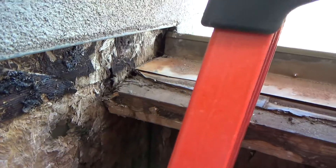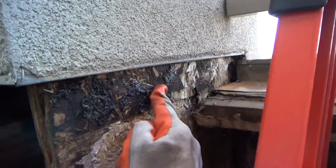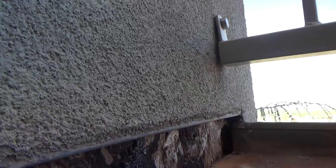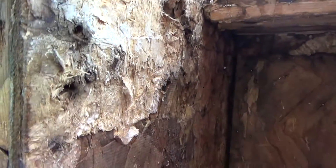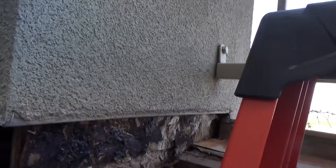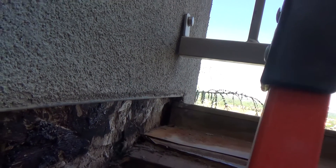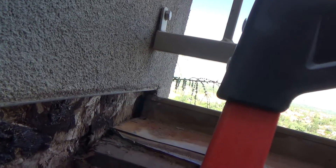I just need enough room to take this plywood off, because I'm gonna end up taking the plywood off up to this corner. See, there's a hole right there from before. If I take that off and take that same piece, then when I cut a new piece I can shove it right through there all the way up, patch it with roofing material. I may end up deciding to take that flashing off, or I can leave the flashing and just catch it right on in.